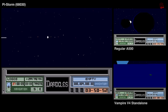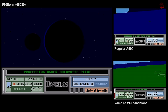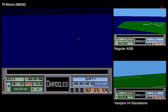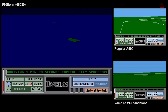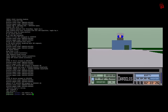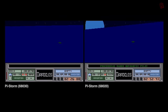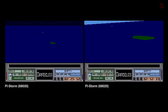The Pi Storm just falls further and further behind in Damocles and it doesn't feel right. To investigate, I took the Pi Storm's config back to a 68020 CPU and ran it again. For comparison: 68030 on the left and 68020 on the right — and the 68020 is returning better performance. I couldn't tell you why. I don't know if the Pi is being pushed too hard in 030 mode or if the software isn't optimized. Maybe the Pi 4 would give better returns when that's supported.